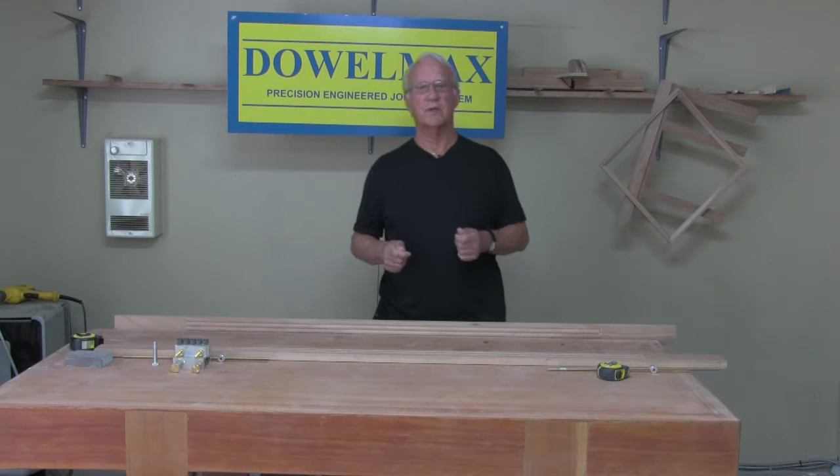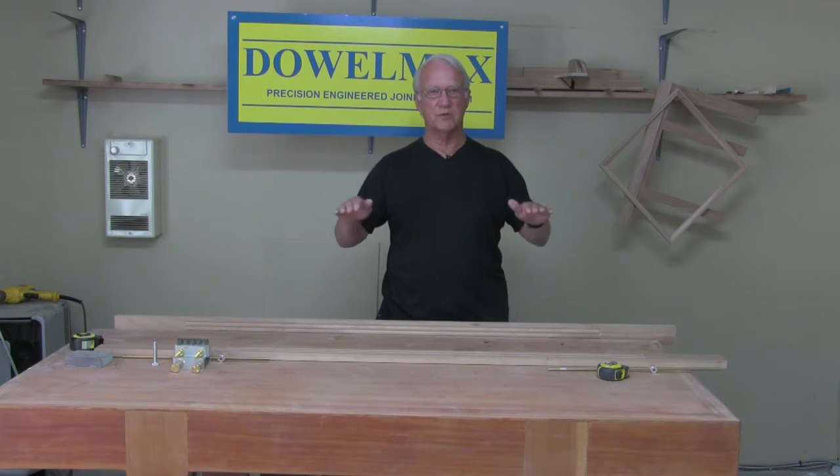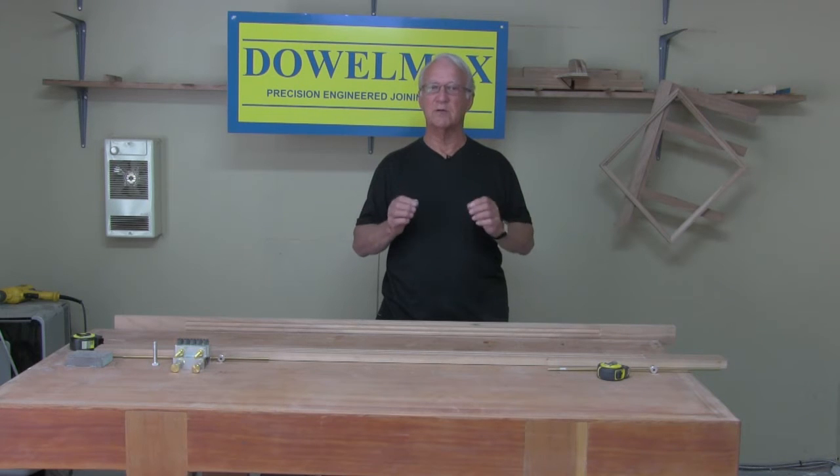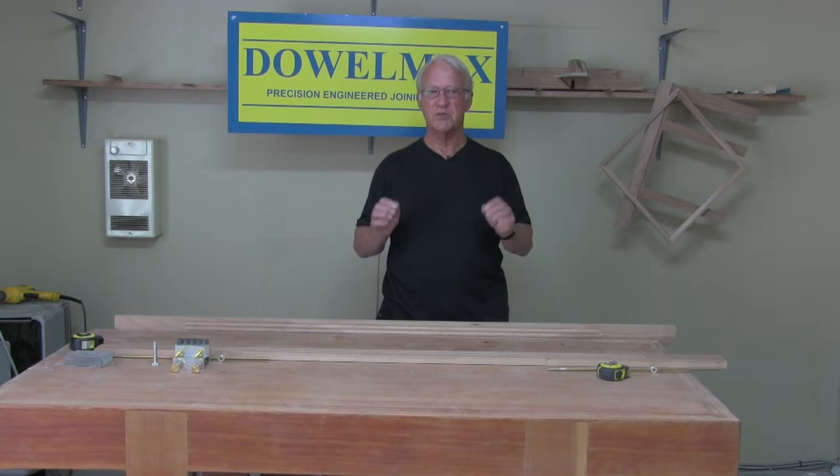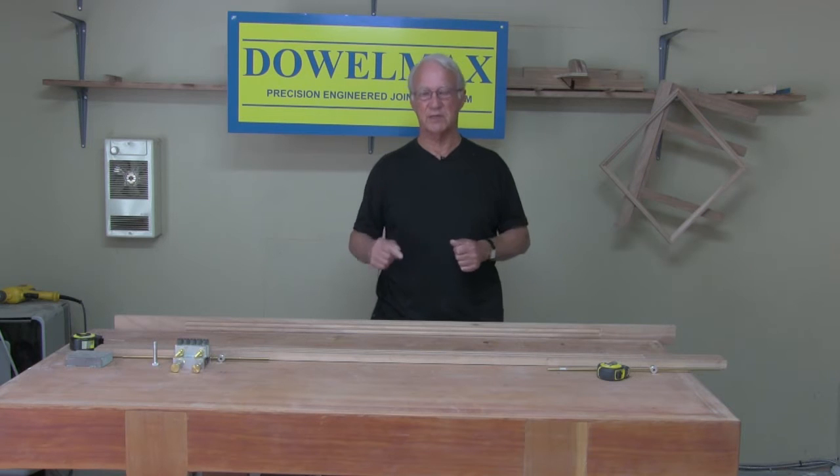Now, in order to ensure that the rails are true and absolutely horizontal, we have to reference the dowel holes on both rails in an identical manner. We can, however, check this accuracy at any point in the procedure by installing 1 dowel in each joint, then fit the 2 posts together, and if accurate, the end should remain absolutely flush. Let's get started.